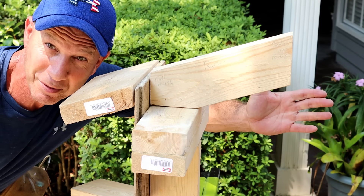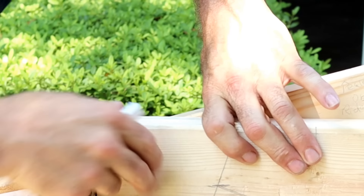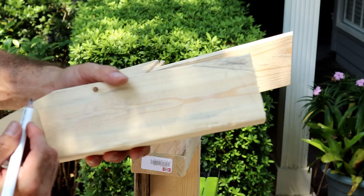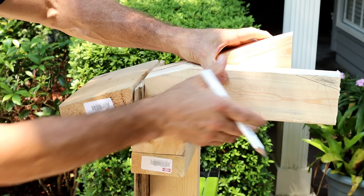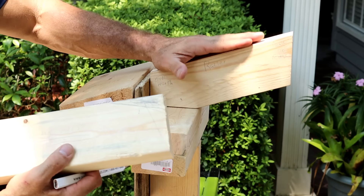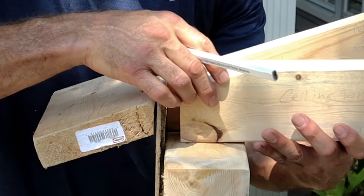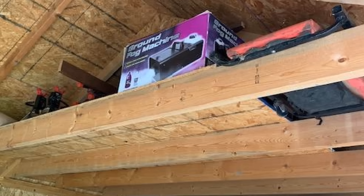I'm not the sharpest tool in the shed, so all I do is take my board, set it flat on here and mark it from the back side. Once you cut that off like I did here, you can use this as a template for all your other boards, and your ceiling joist will be easily cut just like you do your rafters. If I were to build a platform up top like I did in my other shed, I would tie these across and lay sheets of plywood on there so I could put wood or anything up top in my shed.